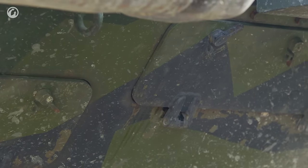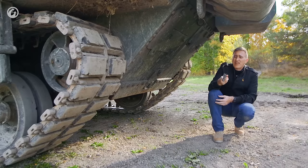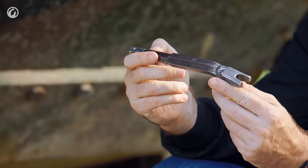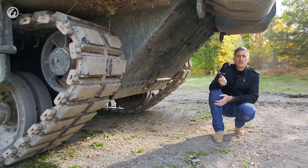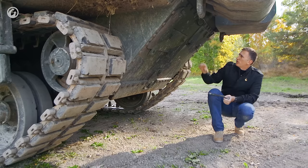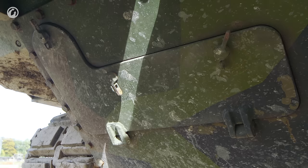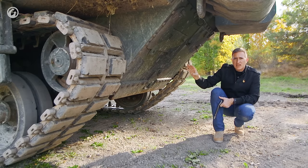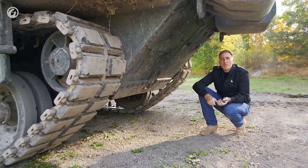Moving down underneath the two stowage bins — an old metal one and a new plastic one — we can see where the ammunition is loaded. First, the universal tool, similar to what's found on Soviet tanks — basically the key to the tank. The Swedes call it a 'klant,' which loosely translates as a person who is an oxygen thief. Nobody's entirely sure why, but it's another case where the official name is never used. There are two ammunition compartments: the right-hand side holds 25 rounds, the left-hand side 20, with an additional five manual load. You can't split ammunition types on the same side — one side must be all AP, the other all HE, though which side carries which is selectable via a toggle switch.